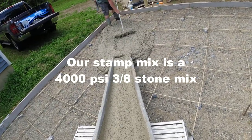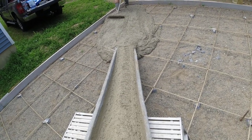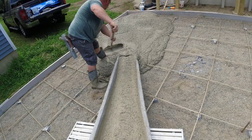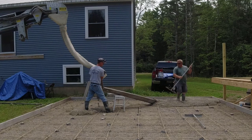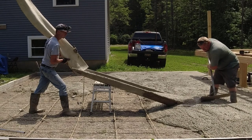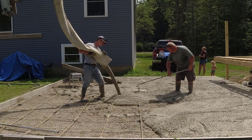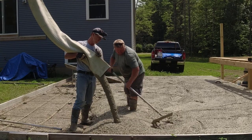A little bit of pulling, but hey, we couldn't get a pump — the conveyor was the closest thing we could get to reaching this. You can see the color of that; it's a lot lighter, almost beige or tan. We want to get this in as quick as we can — remember we're stamping this and it's about 85 degrees out right now. This roller stamp Luke and I are going to be using here in a few minutes is about three feet wide and about 12 inches in diameter, so it's got some size and weight to it. The timing is really, really critical, especially on a slab this size. It's our first time having the opportunity to use this, so you're going to see how it goes. We've got to get this concrete in fast — it feels like it's about a hundred out here.